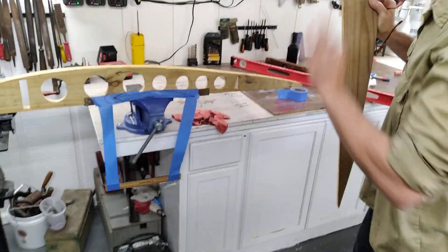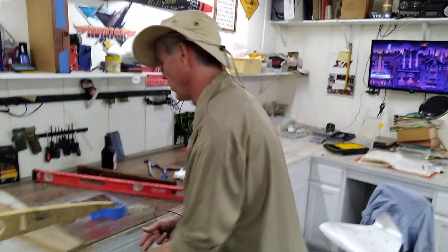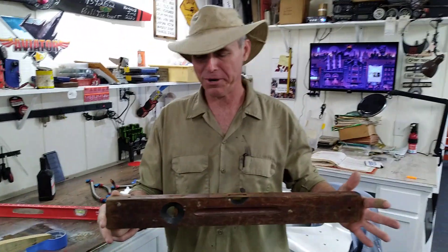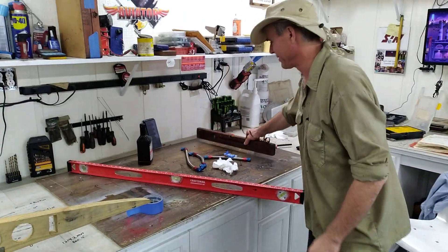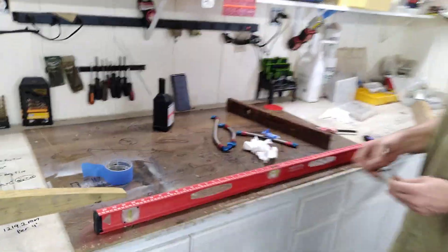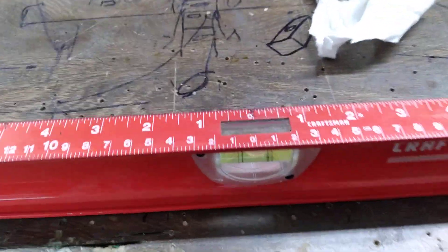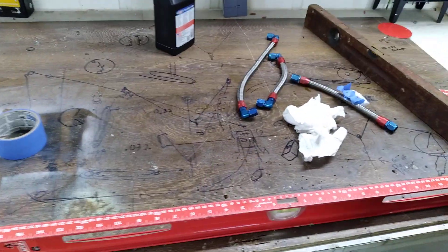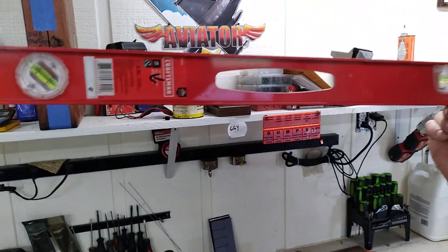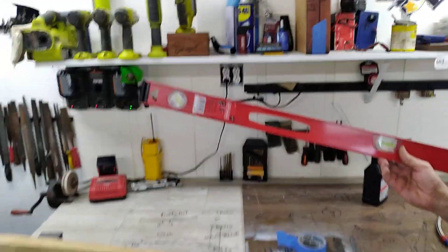You can do this with a regular level. I don't mean grab this — this is my grandfather's level, it's awesome, I actually use it — but for today we're not going to use it. We're going to use a nice, very accurate level. Not one that's been laying in the tool box, gotten knocked around a hundred times and isn't accurate. With a level, you want to check it: I took a look at the bubble — it's a little bit to the right. So is the level off or is the bench off? I'm going to take the level and turn it around, put it in the exact same place. I get the same result — a little bit to the right. So the level is accurate and the bench is off. I'll also draw an arrow on the level because I always want to place it on the aircraft in the exact same orientation.